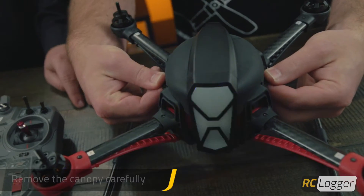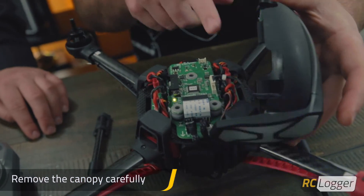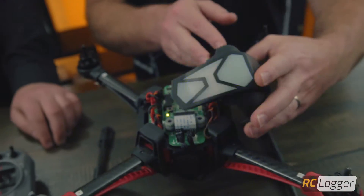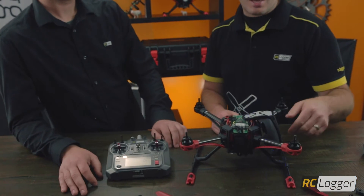What we want to do is remove the canopy, and we have to do that safely because there's a small wire — a cable inside that goes from the main flight controller up to the GPS. We want to make sure we are very careful; you don't want to just rip the thing off. There are a couple of tabs, one on each side. You actually want to push off to one side just slightly and then take it off. You can see the black cable here, so be very careful when taking it off to make sure you're not putting any strain or stress on it. We actually just lay the canopy there — it keeps stress off that cable and lets you see the LED indications.